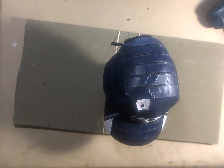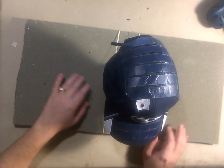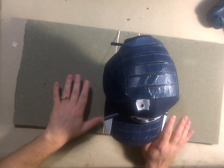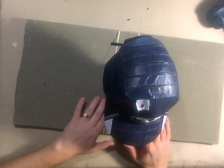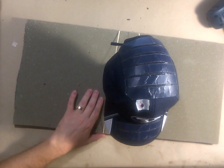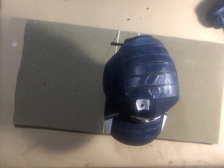You'd want to put it outside — I'd put it on the cement or something, just in case. In theory, these lithium-iron phosphate batteries don't catch fire, don't explode. Anything can happen, I'm not making any guarantees. But if somehow you punctured a battery, you'd take the hat off, put it on the cement somewhere with nothing nearby that could catch on fire, then just let it sit for a good 15 minutes or so, make sure it's good, and then dispose of it safely. The instructions for exactly how to do that depend on the battery manufacturer.